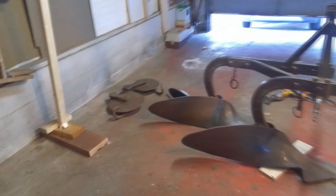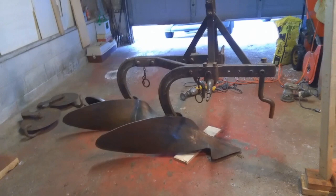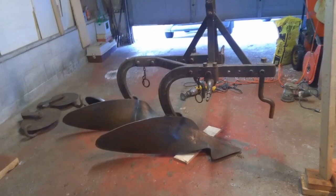She's all cleaned up. The only thing I've got left to do is clean up the cutters over here — I was able to zoom in and get right down to the metal itself, getting all that paint out of there and down to the bare metal. What I'm going to do now is go ahead and put a primer coat on it just to seal this up so the surface rust doesn't come back. I'll wipe it down with acetone first to clean up any loose particles. A couple hours of work and she's stripped down.